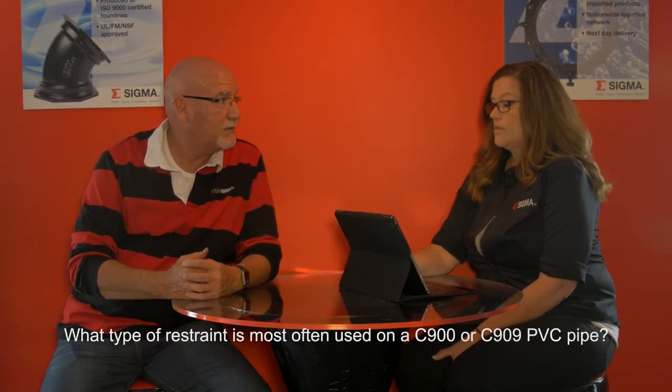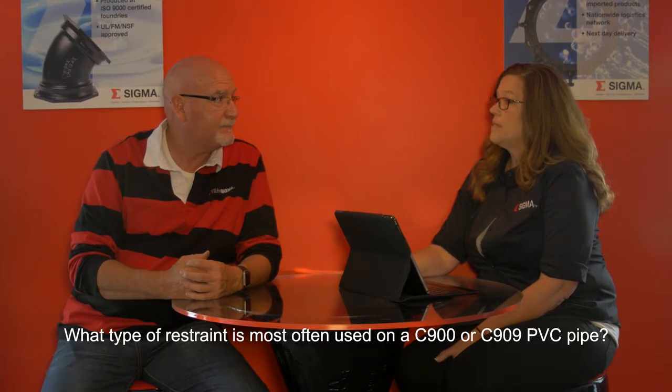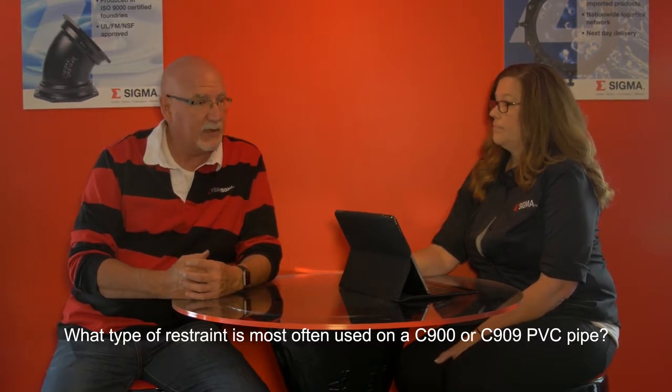What type of restraint is most often used on C900 or C909 PVC pipe? Again, that's a wedge action restraint. You're talking about with an MJ fitting? Yes, with an MJ fitting. That's our part number SLCE, and again we sell that as loose, which would be an SLCE, or in a pack, which is an SLCEP.